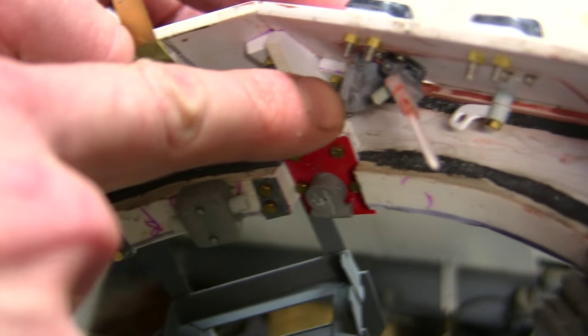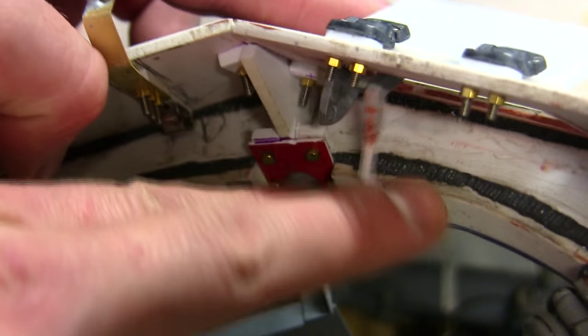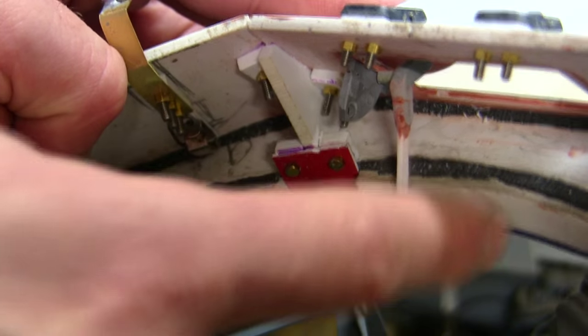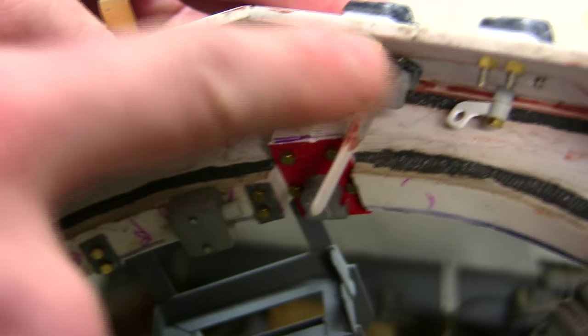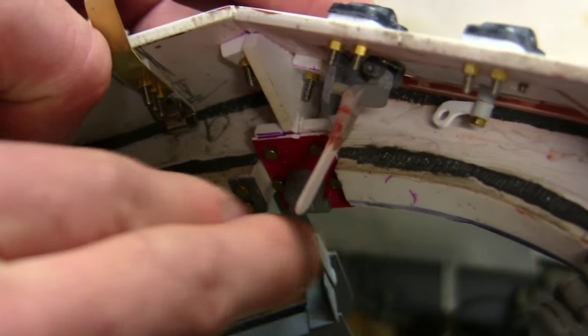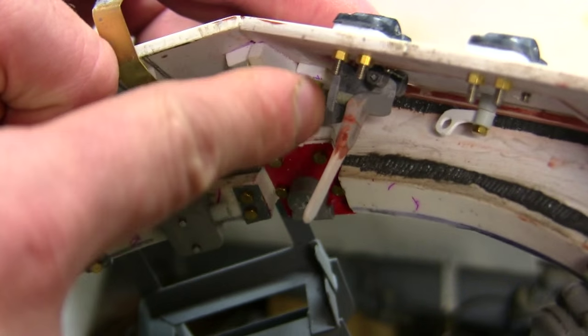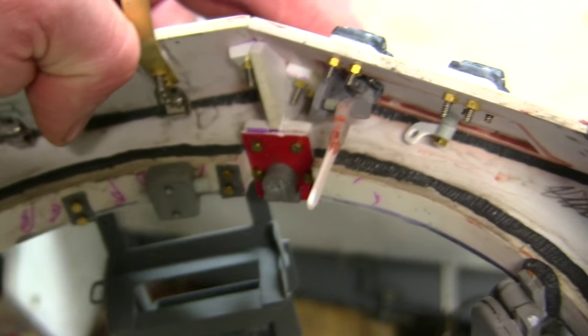The system is designed such that in order to open the hatch, you need to pivot this handle — which is connected to this lug — out of the way. This disengages the lug from a securing hole and allows you to open the hatch. There is another securing hole on the bottom in which the handle then locks in place. On the real 222, this component is spring-bound and has a reset on it, but due to the scale of the model the spring feature was not added, though the piece still functions in the exact same way.